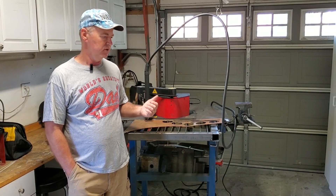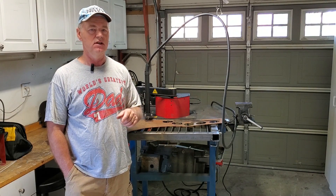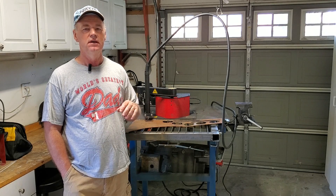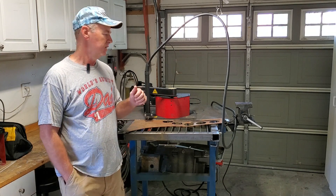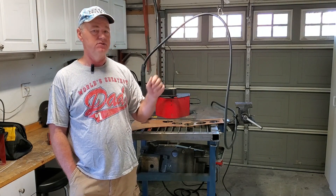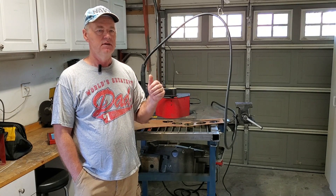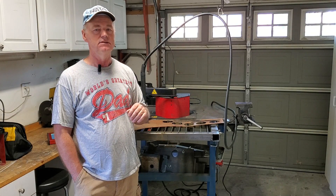It's been a while since I've been in the garage with the ArcDroid — over a week or so — but I'm back and the ArcDroid's back. At the beginning of this video I started talking about replacing the board. Since then, I've gone back and forth with Andrew because I had an issue. The issue turned out to be that one of the plugs for the sensor that senses the top arm, the back arm, wasn't making a good connection. In the end, all I had to do was reseat those. Andrew picked up on it immediately — that was not difficult.